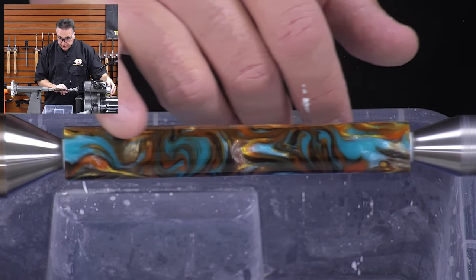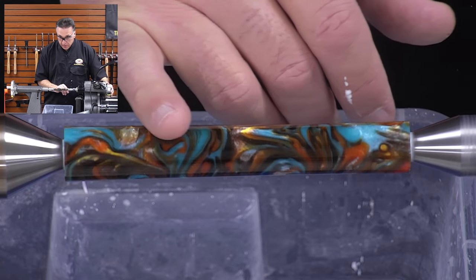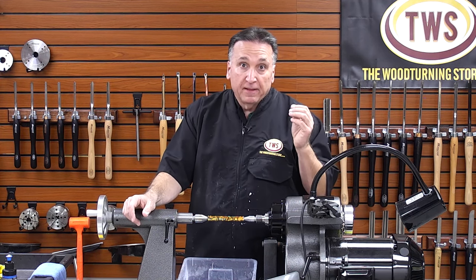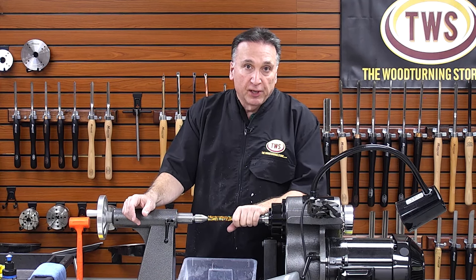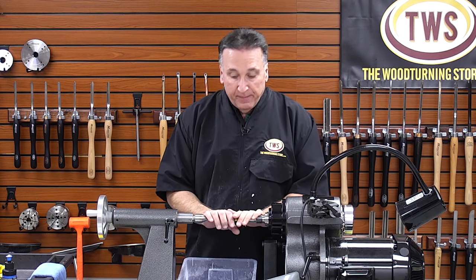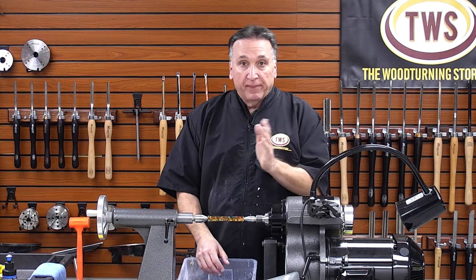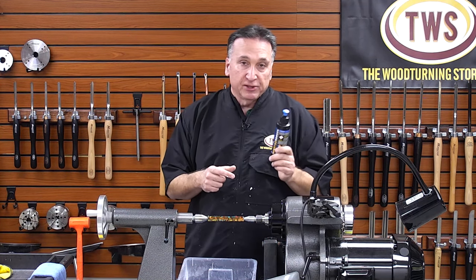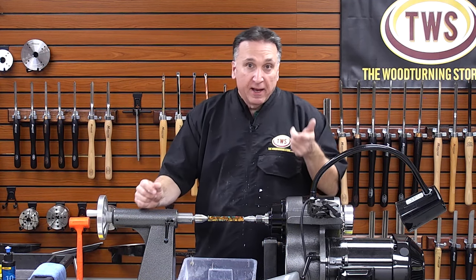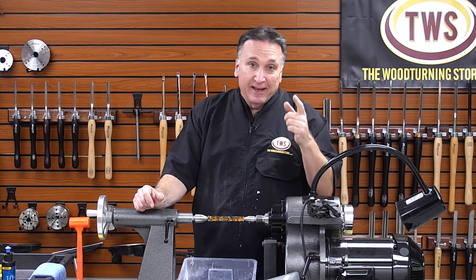That is a really nice finish — hopefully you can see right in here some of that iridescence of the mica powder shining through. That's really all it takes. The key to sanding and polishing acrylic or resin blanks is that the material has to stay cool — there's no better way to do that than with water and wet-dry sandpaper. Wet-dry sandpaper can only get you to about 5000, which isn't enough for a super shine, so above 5000 switch to an automotive-type polish of your choice — Mirka, Meguiar's, 3M, and so on. I hope that was helpful — go back and check out the first video on how to turn these blanks, and thanks for watching.